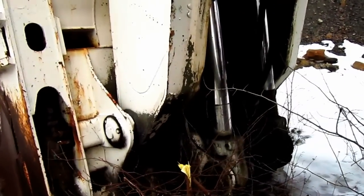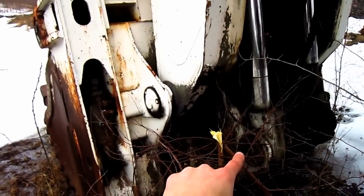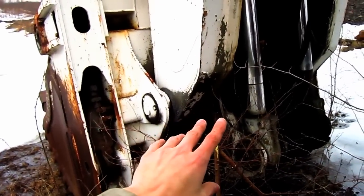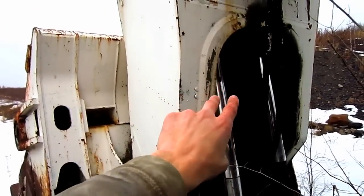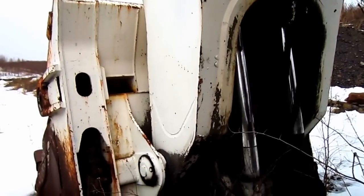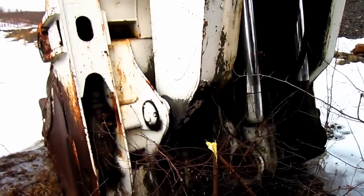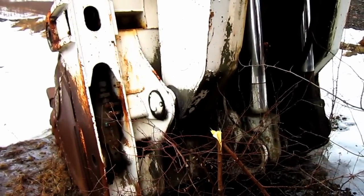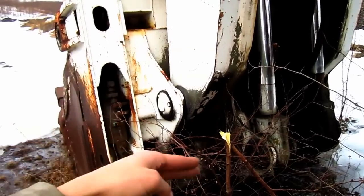On the back of the stick, you can see where the two bucket cylinders are located and where they connect to the back of the bucket to curl the bull clam in or out. Both of these cylinders are mounted up inside of the stick. This similar design was also used on some older Liebherr and Demag shovels. The design itself was supposed to protect the cylinders more and also allow for the bull clam to curl back further.